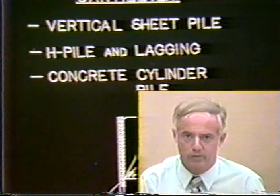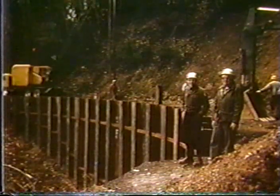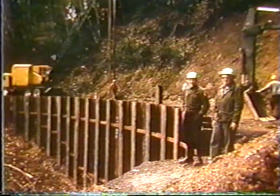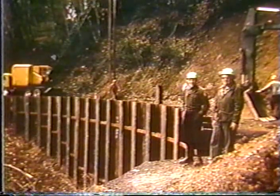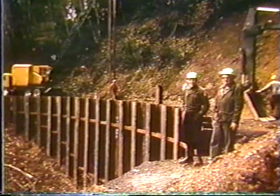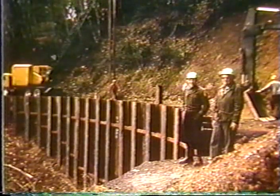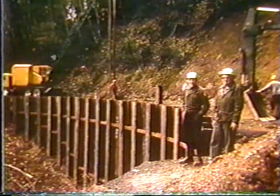And this is one area that is very important to understand, and that's why you need to get your friendly soil mechanic or geotechnical engineer to make sure that you put the foundations deep enough to resist the forces involved. Just a few applications here, again, some projects done by the Forest Service, where you drive piles or sheet piles, and that is quite sufficient for low walls, and if you've got the right equipment, quite effective retaining